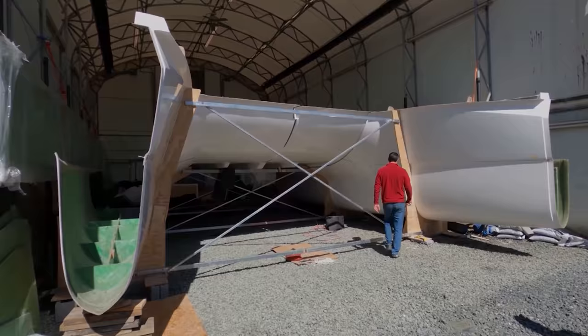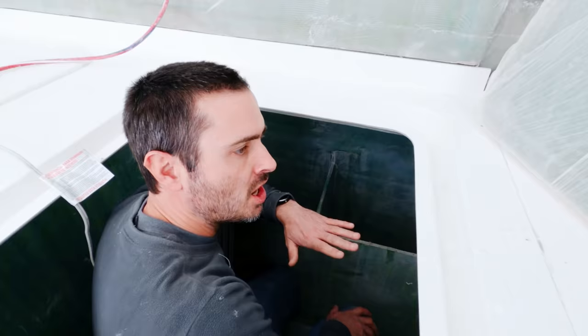Day three now of water tank work. Yesterday Matt spent all afternoon in here sanding his fairing compound to a smooth finish. Yeah, it worked out really, really well. Even for that quick fair that I did, which as you'll see, I did not put on a lot. Unlike the areas where Jess is working, where you have to be able to look down it and it has to look completely flat. This, I don't care if it's flat or not. The goal was just to knock off those edges so I didn't have to put on a ton of fairing compound, which means I didn't have to sand off a lot of fairing compound either.